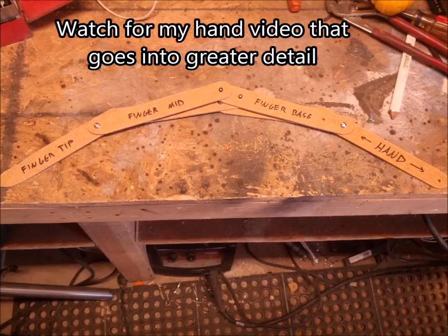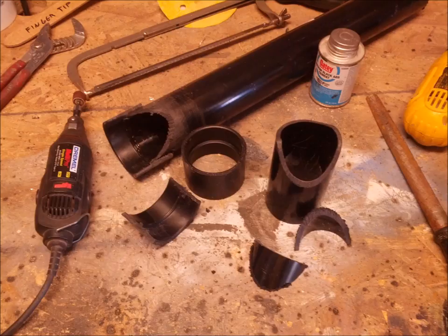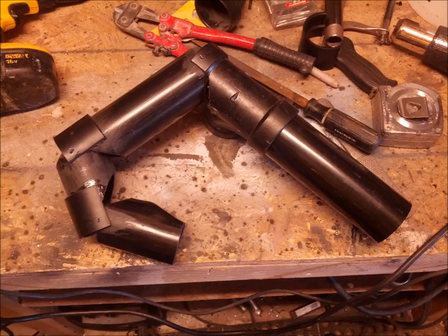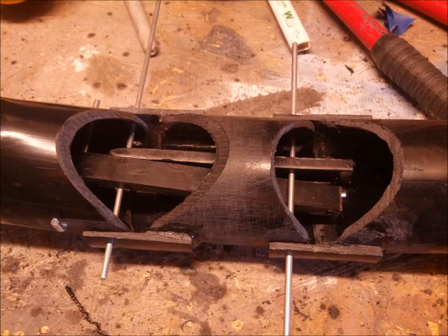I worked out the pivot points on the knuckles and the pivot points on the internal moving parts. The actual fingers are made up from two-inch ABS plumbing pipe — here is one finger segment. To work smoothly some of the plastic needs to be ground down, and a sanding drum on a Dremel works pretty good for this. Here's one finger made up of straight sections and couplers cut in half, and a finger section being joined to the palm with the internal components that cause the finger to close more naturally.